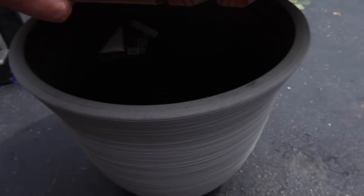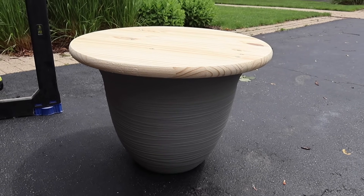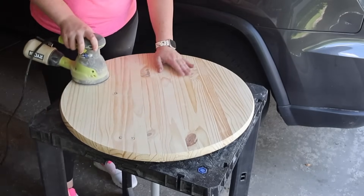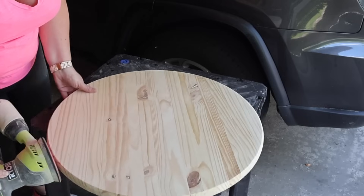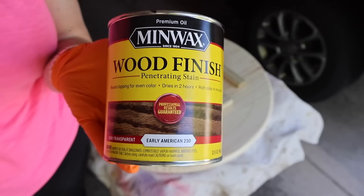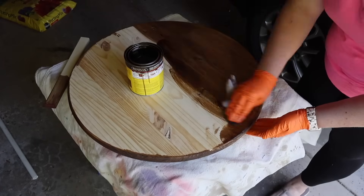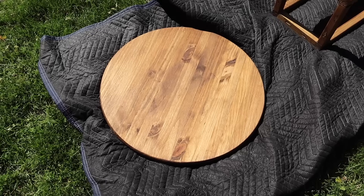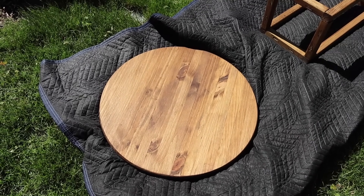You can do this for square pots as well, but I like that it's going to sit in there and not move, especially if people have drinks on it because I'm going to use it as a side table. I'm giving this a really good sand, especially on the edges, because these pine edge-glued rounds can be a little rough. Once I got it all smooth, I wiped off the sawdust and it's time to finish it. I decided to use Early American stain since that's what I have all around my house, and once I'm done in the summer I'm going to bring this inside for winter storage.